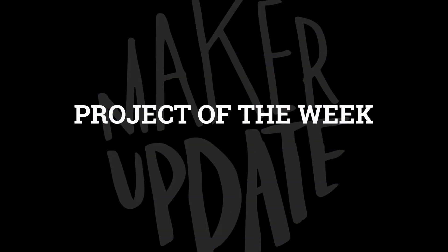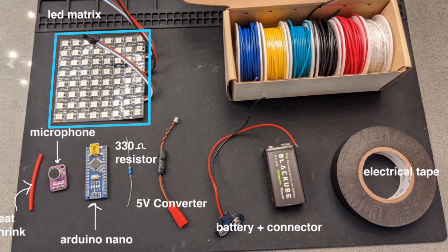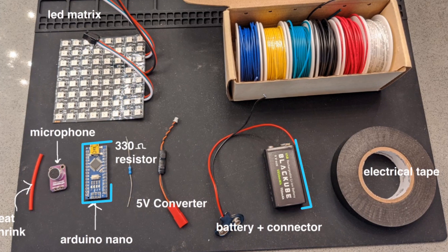Let's get started with the project of the week. Tyler Glale made this LED matrix face mask with an animated mouth that responds to your voice. Best of all, it's pretty cheap and simple to make your own. The most expensive part is this 8x8 flexible LED matrix that runs around $15. You add in a 9-volt battery, an Arduino Nano, a microphone breakout board, and a little DC to DC converter to bring the battery voltage down to the 5 volts needed for the board and the lights.